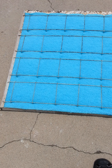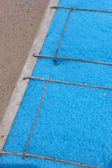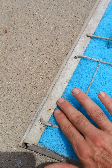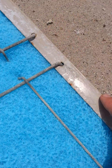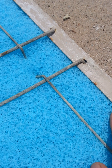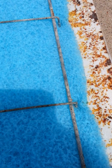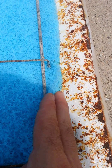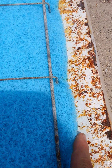Here's what the frame looks like with two pads and the retainer clips in place. The pads are pillowing up just a little bit and nice and tight at the edges. I measured the entire length between the interior edges from one side to the other and cut the pads to exactly that length. I did the same for top to bottom, but went just a little bit more because they tend to shrink down over the course of the cooling season. I didn't want a gap at the top where hot air could mix with the cool moist air that had gone through the pads.